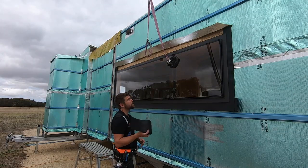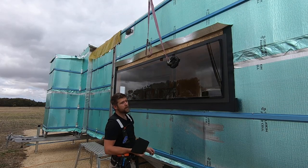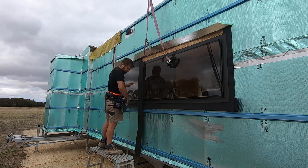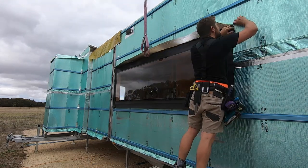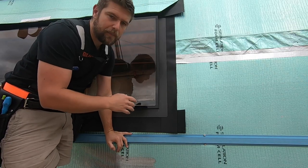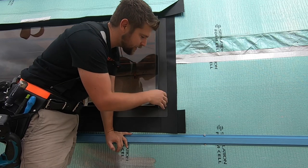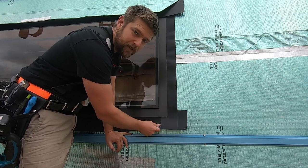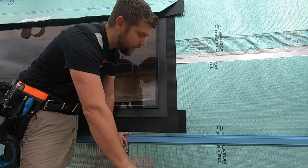Now the last steps, come out, put the flashing along that top piece, fold down the building wrap, we're done. So now you can see we have a constant overlap. When the moisture pushes in past the window here, it's going to hit this weather fin and run down off onto this bottom flashing here, down over the building wrap and away from the house.